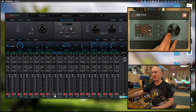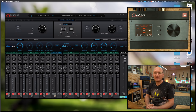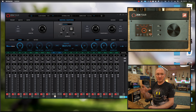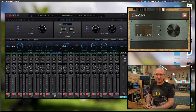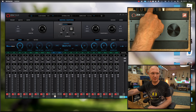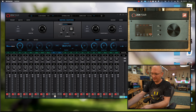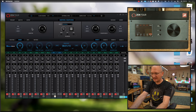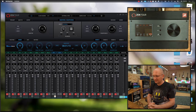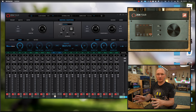How are you hearing me, by the way? Well, because I can't record in Cubase because I'm showing you an audio interface, I'm actually routing myself, I'm going with a shotgun mic right there, into the Zen Tour Synergy Core on, as you can see right here, channel 1. And I'm rerouting that out of this D-sub, which is the 8 individual outs, the line outs, and I'm recording in a Zoom recorder right here. And I just had the hardest time actually getting a distortion-free level happening. Seems to be because of the line out volume of the Zen Tour, which we'll get to.